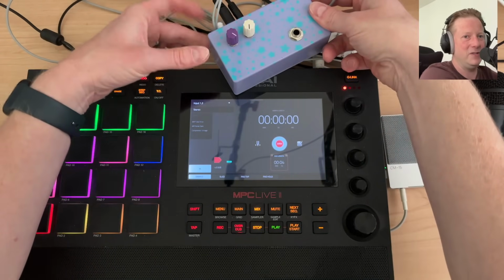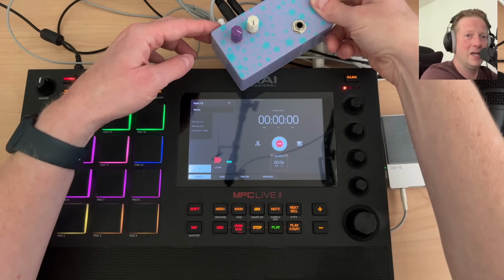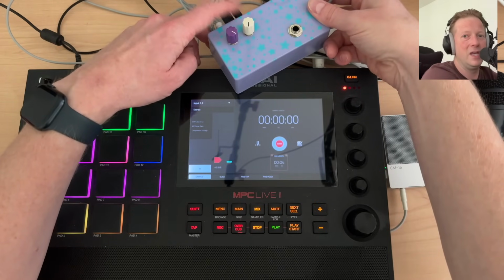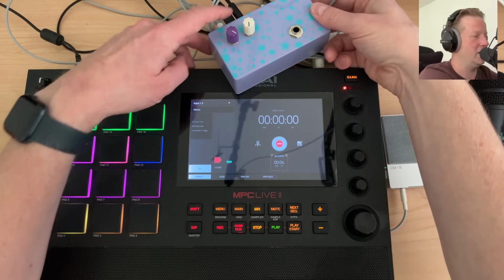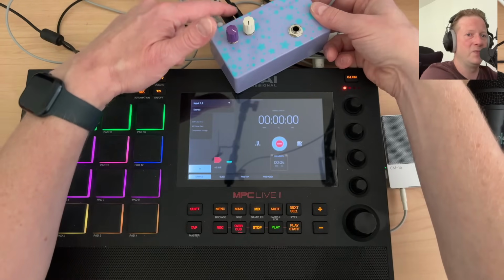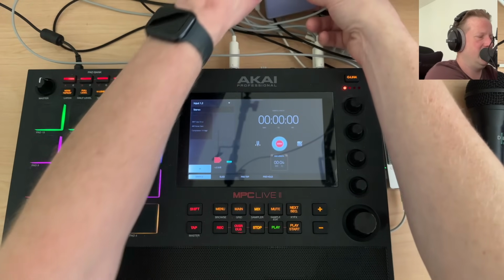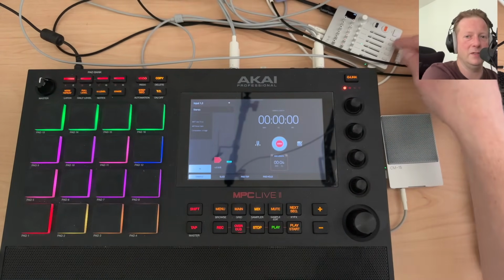The important thing is it's creating a TRRS jack that is doing headphone output, and then it's got a line input. The reason I'm doing this is the output from my chain down there is line level. And by bringing it into here, I can take advantage of a feature on the TX6.